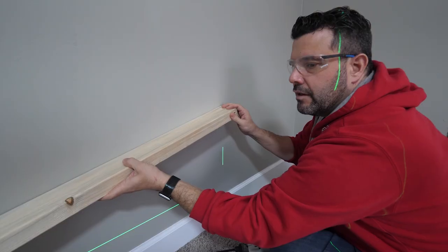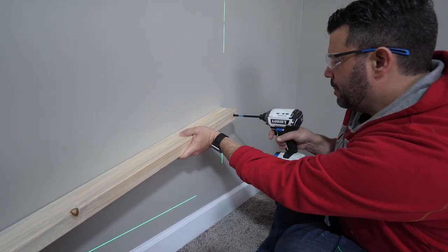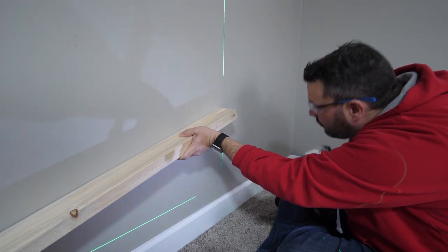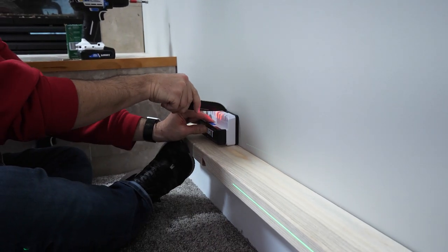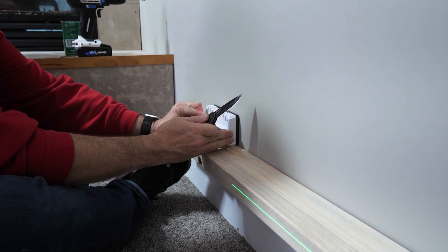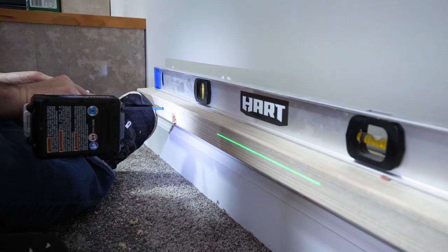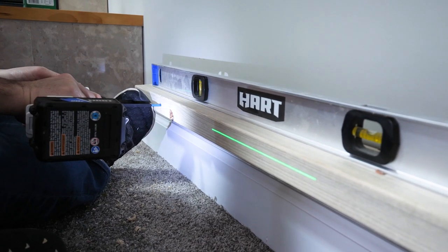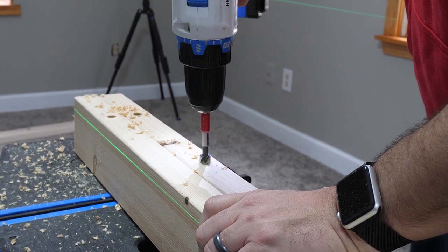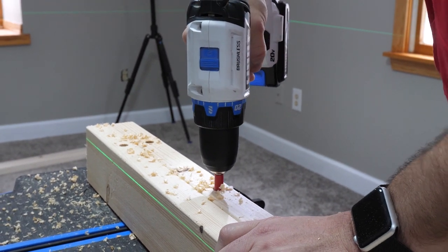The floor wasn't level at all — this room had been someone else's DIY project before they bought the house, and it showed. They used the laser level to mount things level rather than measuring from the floor or ceiling. It was important to screw everything firmly into the studs, which — not surprisingly — weren't exactly 16 inches on center. They used a Hart stud finder, helpful for finding not just a stud but its center. Two small vertical studs were drilled with pocket holes on the mobile table and screwed into the wall.